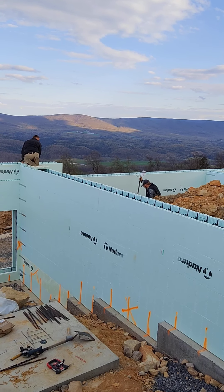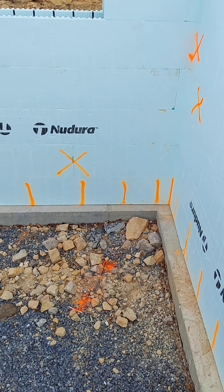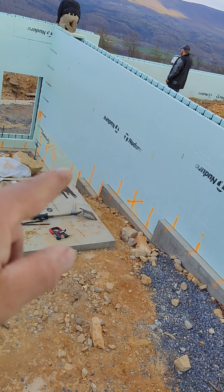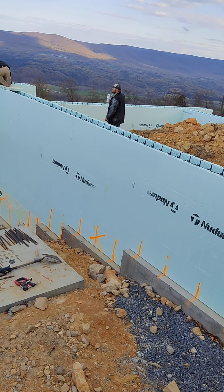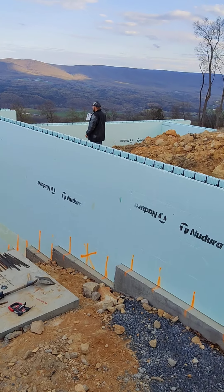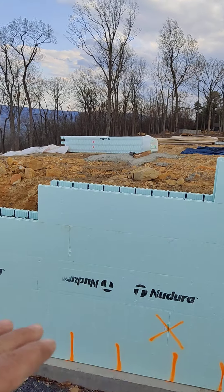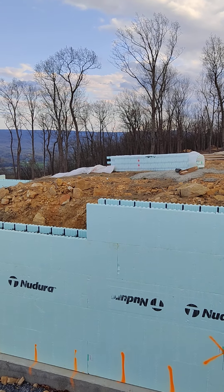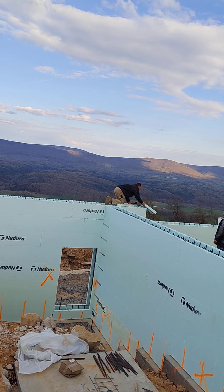There will be an alignment system put on all this, but we're not able to put all of our gravel in and stuff like that. We've got a ton of step footers — those right there where it steps down — and at the different levels we have, we weren't able to bring that material in. So we're probably going to go with a product called the Zook alignment system, which allows a horizontal board alignment versus vertical. Those brackets mount to the form instead of a rail system, so it'll be a little bit easier to tie in down here on the ground.